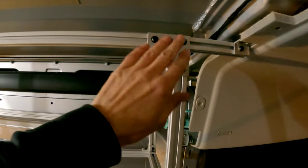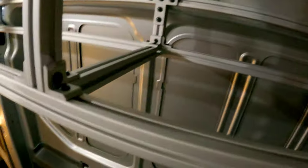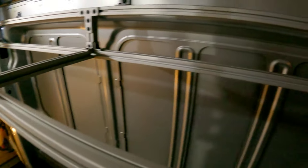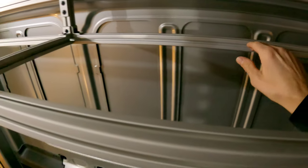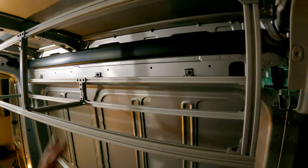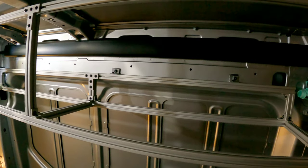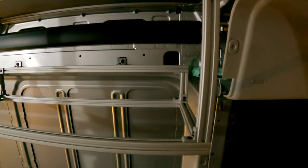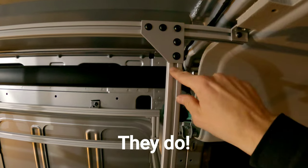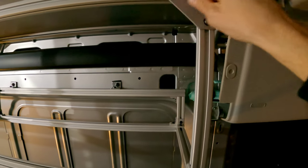You may notice I used flat corner brackets here — the reason I didn't use them everywhere is because the base of these cabinets is going to be quarter-inch birch plywood, which I'll finish and it'll fit right into the channel. I may add door fronts at some point, but for now it'll just be open and I'll run bungees across to keep helmets and gear in there. The last thing to do now that the assembly is done is plant this rib nut, mark it, drill it, set it, and then the framing will be done.